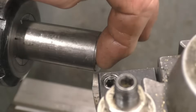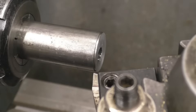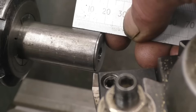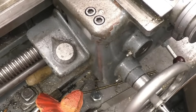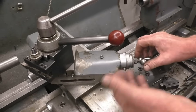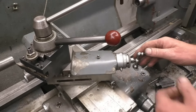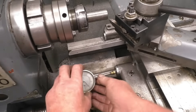Now the tip of this tool is exactly on the end of the bar, so we need to measure from there to the shoulder. There are a few ways of doing it depending on how accurate you need to be. You can simply put a ruler on the end, put a mark on, and do it that way. If you need to be more accurate, you need to start measuring things. This is the handwheel that makes the carriage go back and forward along the ways of the lathe — there are no markings on this one at all. The compound slide is calibrated in metric, so you could turn the compound slide in line with the ways of the lathe and use that to dial in however far you want your shoulder. Another method is to use a dial indicator.